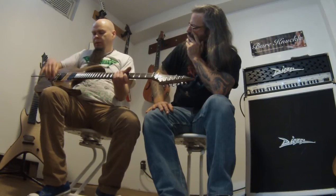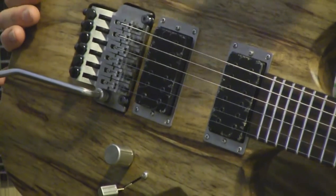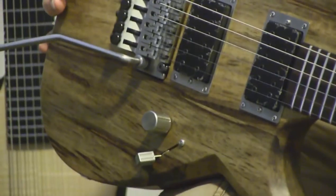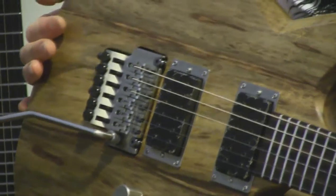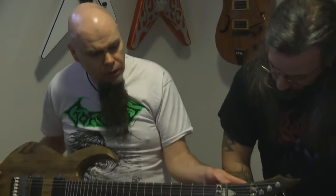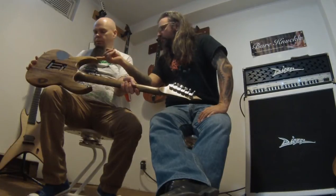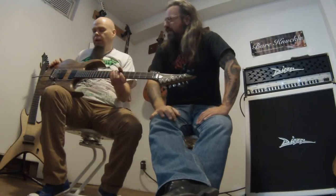I went all out on this one. I bought the Blood Rose titanium. I did all my parts myself except for the knobs that I got done by a machine shop. Those pickup rings — I cut them all out on a saw. They're all 1/16-inch thick titanium. I have a metal bandsaw for that, and it wears the blades out fast. The logos are inlaid in titanium as well — truss rod cover too. The jack plate is on the side, and there's also a back plate.